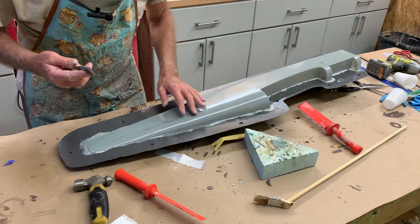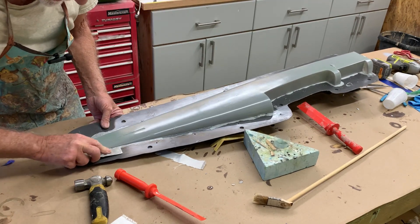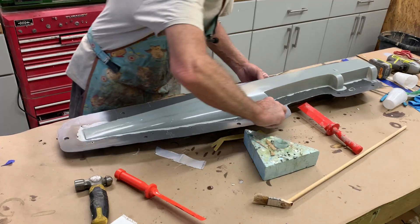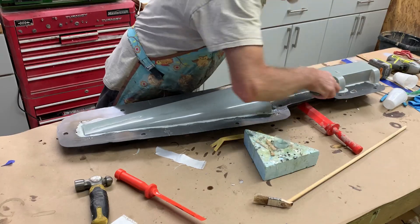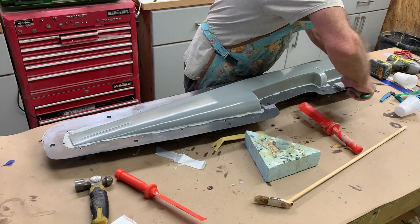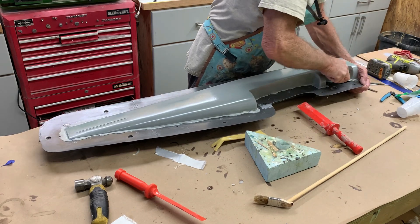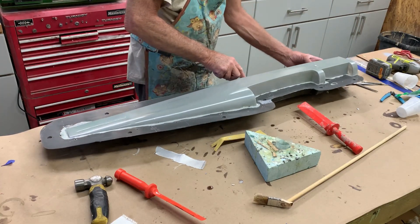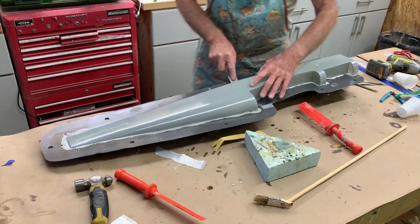This is where I do cheat and use a metal scraper — I just go very gently, it's flat so it doesn't dig in, and run it down to break the flashing away. I could probably just yank this thing out and it'd be okay, but I don't want to risk the part splitting. If you've seen my A6 videos, you'd see where when I was demolding the fuselage it actually all separated — because I was taping that one after getting it out of the mold, whereas this one I taped while it was still in the mold, fresh and laid up.